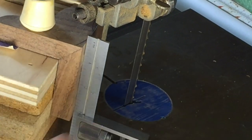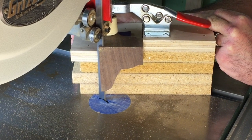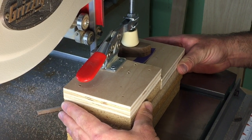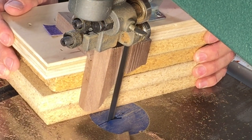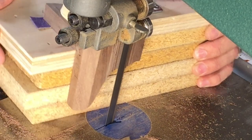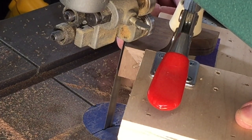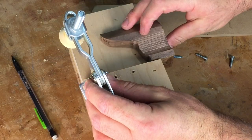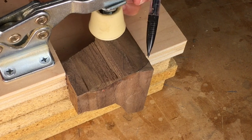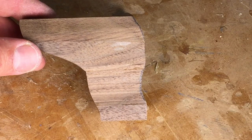Check to be sure the work is square to the table and parallel to the blade and begin shaping. I use a pulling motion across the blade from back to back to further refine the curve without cutting too deep. To cut the other face, the clamp needs to be repositioned to the other side to hold the work. Notice the profile does not need to be transferred again as the end grain from the first profile is revealed — this is a guide to follow for the second cut. Just darken the line with a pencil and it's rinse and repeat. The end result should look like this.